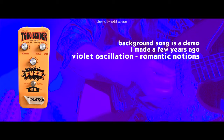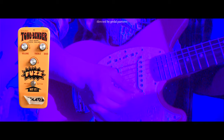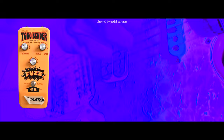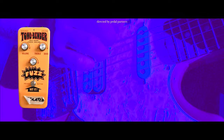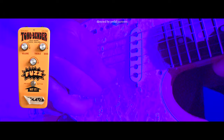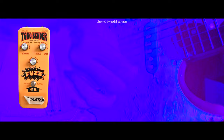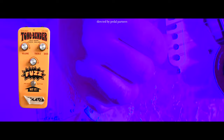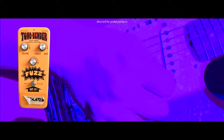Jake goes on to say: the cure was a Germanium diode wired in reverse across the base-emitter junction of the transistor. This junction is itself a diode, resulting in a drifting DC biasing point derived from the input signal. Putting another diode across the other way cancels this effect — since the plus and minus signal paths are now equal resistance, this results in no build-up of DC. Another advantage is that the temperature-dependent Germanium leakage currents cancel. The first units used standard PNP Germanium transistors requiring a negative power supply; he solved this by finding a high-gain NPN transistor — the Mullard OC140, an old computer transistor from 1959.